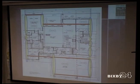Right, one more question. For the wall back to the second bedroom dining room, if you use the hold down, I don't know how far the window is from the corner. This one here? Both of them, the other one, bigger. For this one here, you only have 28 inches. You have 28 inches. You can't count this, you got 24 inches here, yes. But that 24 inches has nothing to do with anything right here because it's not at the end of the braced wall line.